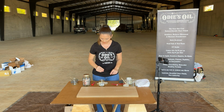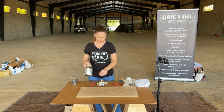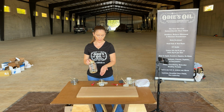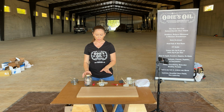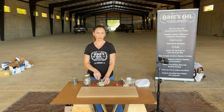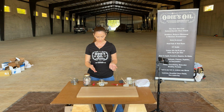Okay. And I'm going to prepare now the safer solvent-based stain, which will give you a rich stain, or if you want to leave it transparent, you can do that as well. And it's very important for a rich stain, the ratio. The ratio is 2 of the solvent, 1 of the oil, and 2 or 3 of the pigment. And for a ratio, you can use a tablespoon, for instance. So it will be 2 tablespoons of solvent, 1 tablespoon of oil, and 3 tablespoons of the pigment.